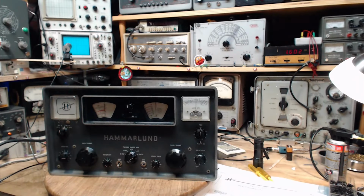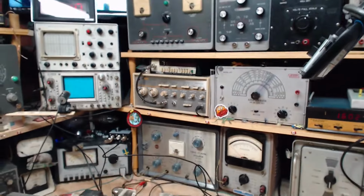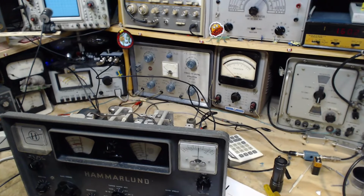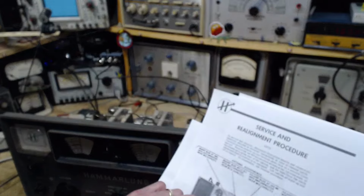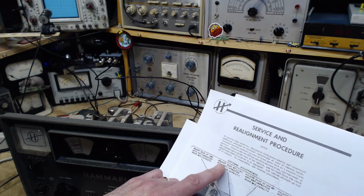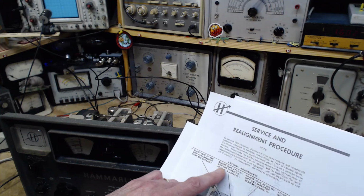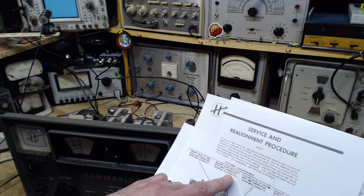Now, the next thing is adjusting the antenna adjustment. Are you not kind of adjusting it for the antenna you're using? It's not just out there. So I have a signal generator connected here. Adjust slug at 1.2 with antenna capacitor near minimum capacity.